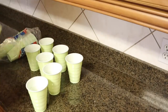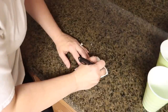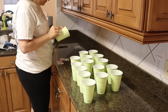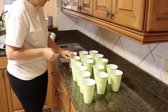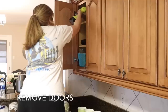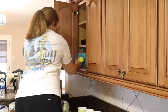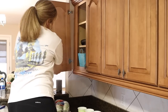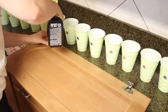I'll take you through the whole process from start to finish and will have all supplies linked in my description box. I started by laying out all my solo cups and getting them labeled, then I marked all of the doors with a number before taking them off. In cup number one I have all the hinges and screws for door number one, so I don't lose track. Since I did my kitchen in two parts — top cabinets first, then bottom — I was able to reuse the same labeled cups for both halves.